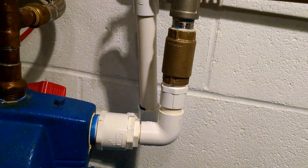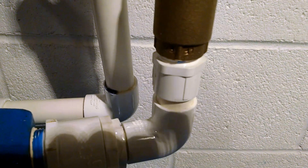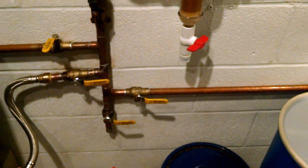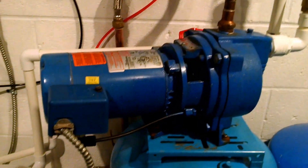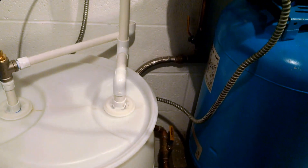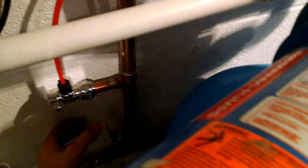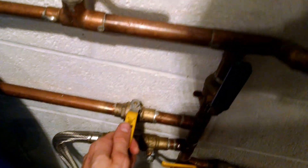Every time I've seen a piece of galvanized I've worked on, especially the newer stuff, it just doesn't really seem to hold up. In this case, I have salty water coming out of my well — it's got a little bit of brackish going on, depending on the time of year — which is the reason why I'm running this rainwater system in the first place. I want to get some drinking water that's not salty. If you really had a lot of downpour, you could very easily connect this rainwater system to the main system of the house. There's a valve right here which connects this whole entire system to the rest of the house.